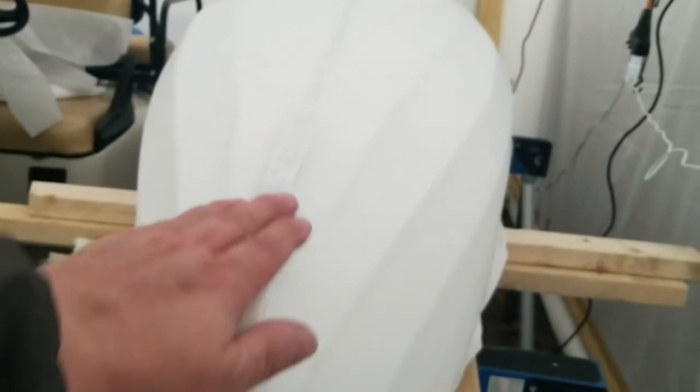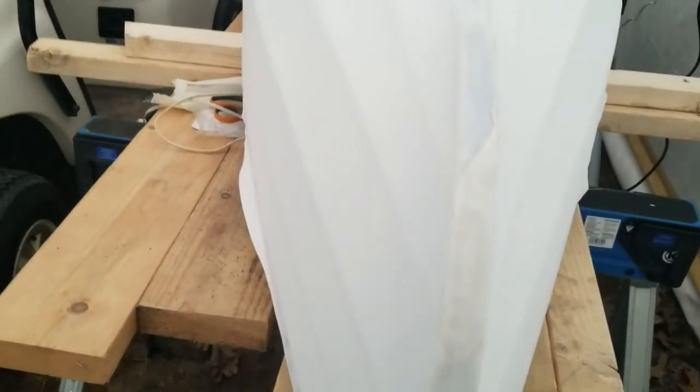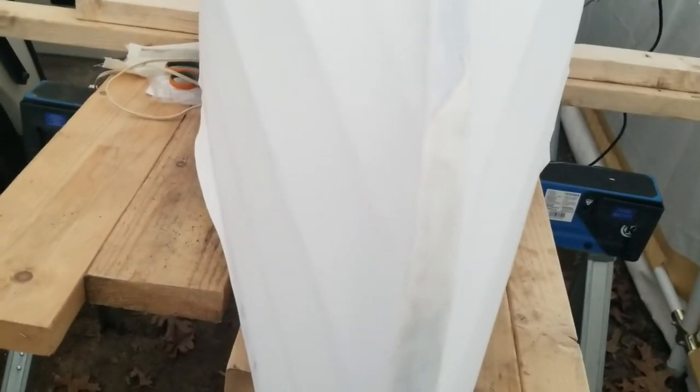I guess I should tell you, over the bow and stern, I like to put like a skid plate. All it is, I use a quarter inch piece of ash, not even quarter inch, probably 3/16, bent to the shape of the bow and stern. And then what I do on the back of that, there's a product called Through the Roof. It's a clear roof sealer for, you know, like leaks, you get a stick through your roof or whatever, and you don't want to replace the whole roof. You can just buy this stuff.